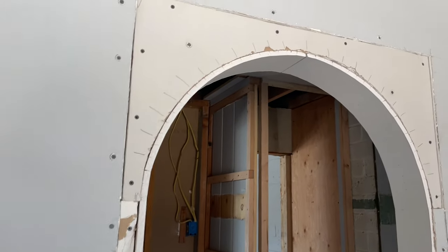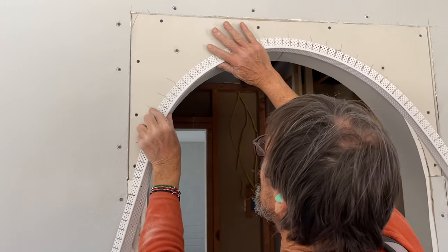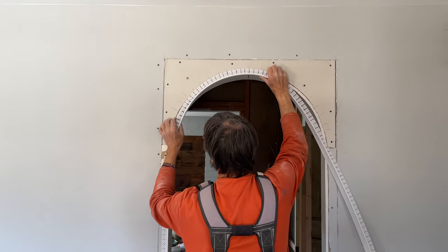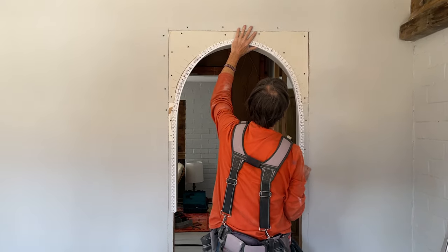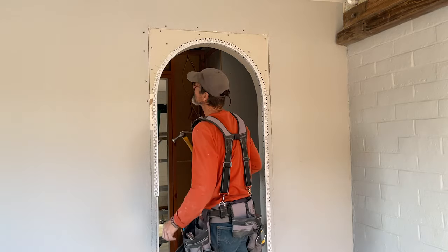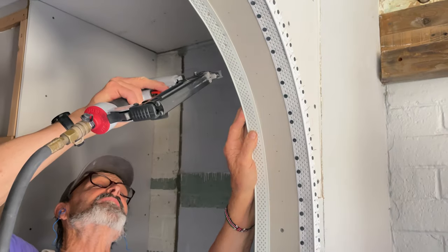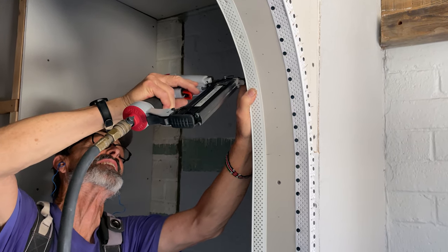The next step is to attach what is called flexible corner bead. You can usually find this at Home Depot, Lowe's, or your local hardware store. We were only able to find one piece so we ended up cutting a regular piece of plastic corner bead to mimic the flexible corner bead — it's not really recommended but it will work in a pinch. Just be careful when you cut it not to let it bend too much otherwise you may end up with a crease. The easiest way to attach corner bead is with a staple gun. As you can see in the video we started off using drywall nails — it did work but it took forever. So grab your two-in-one staple and nail gun because it's 20 times faster.